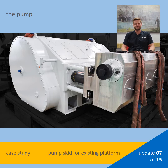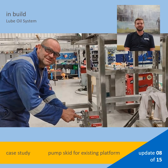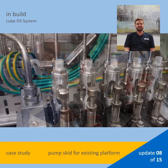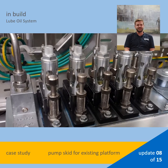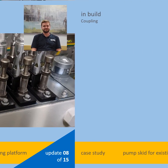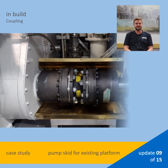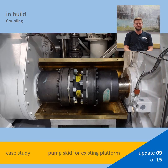In addition, the internal suction and discharge valves are designed specifically for aggressive slurry injection processes. These valves have clear flowways with specifically formulated replacement inserts for resistance to acids and abrasives. This is Richard working on the pump packing oil system. Our packing oil systems deliver a fixed flow rate of oil, removing the need to adjust for different operating pressures. Using an oil system decreases component wear and tear when compared to using grease on the packings. The coupling on this unit is API 671 compliant, with the exception of a shorter distance between shaft ends. This allows the overall package to be as small as possible. This all-metal disc coupling requires no lubrication and incorporates a plug-in feature to allow installation and removal without disturbing the pump alignment.